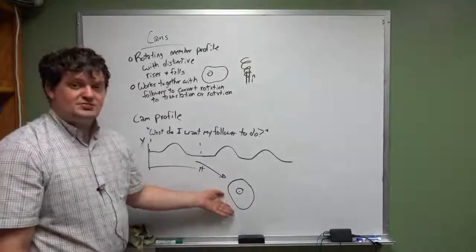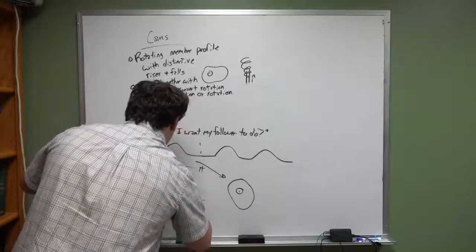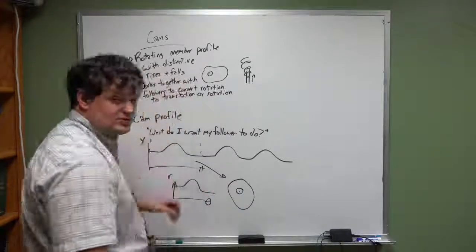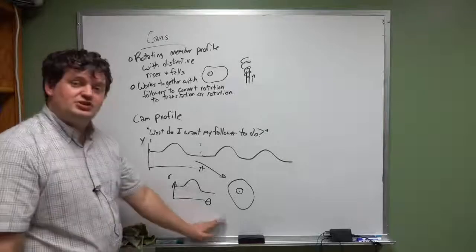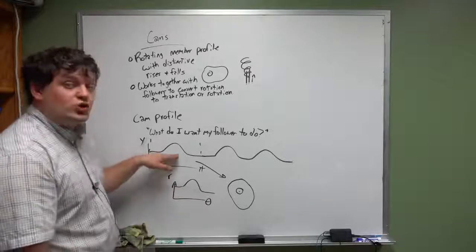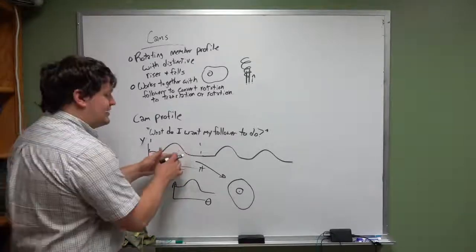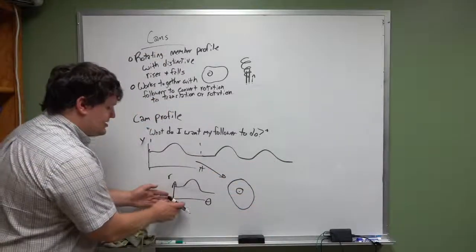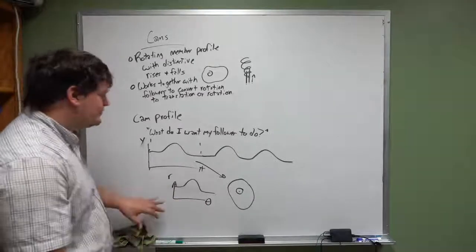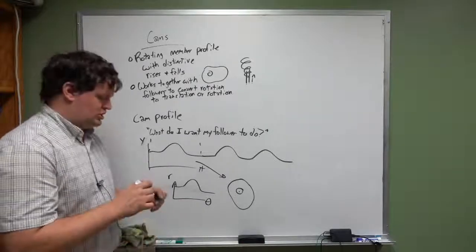And this is the cam that gets produced. You take your y of t, you transform it to now an r theta. And your r theta looks like this. With a rotation of your cam, you get a different radius. And that different radius looks exactly like this, and it produces this kind of a movement out of your follower. And this becomes repetitive because as theta reaches 360 degrees, this whole thing starts over again. So this is the fundamentals behind how to design a cam and how cams work.